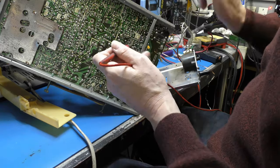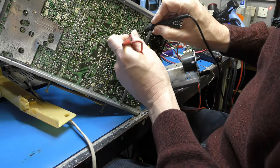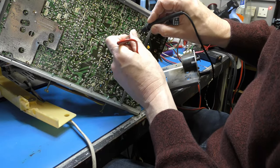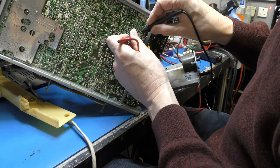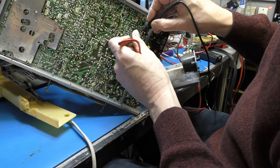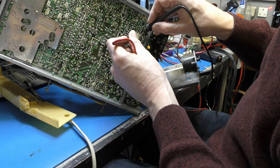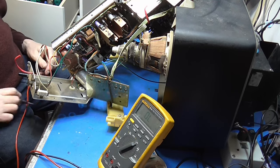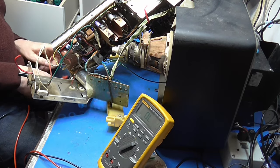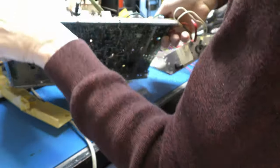TR551 and 552? Let's just pop that on diode and have a little poke around there. But this shouldn't be an issue because if it was, our transformer would isolate the winding. And of course, they're absolutely fine. Curiouser and curiouser.